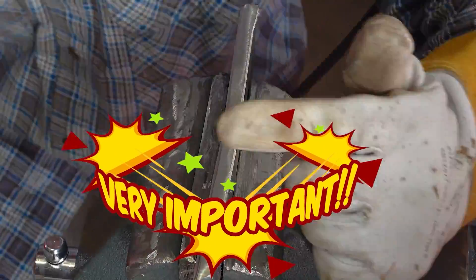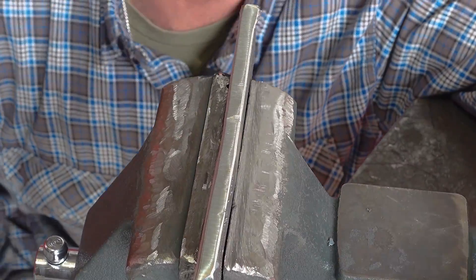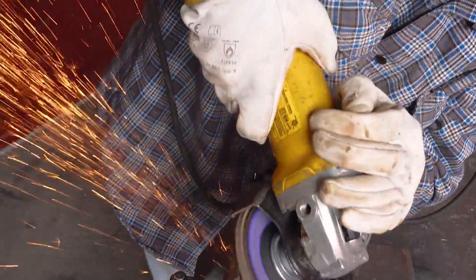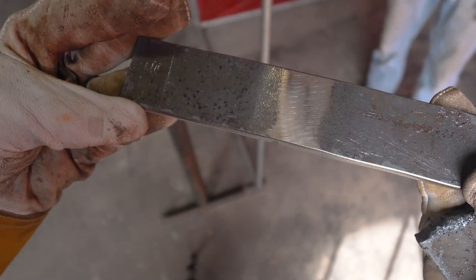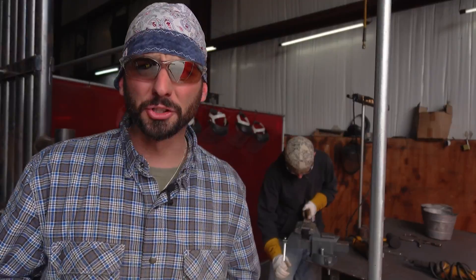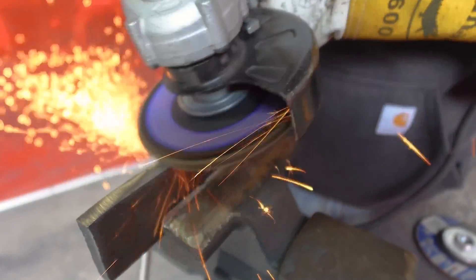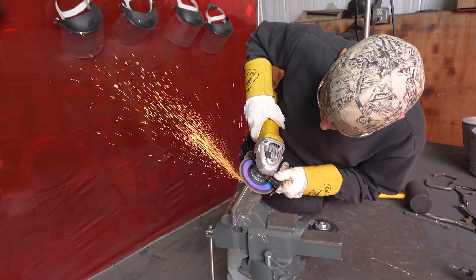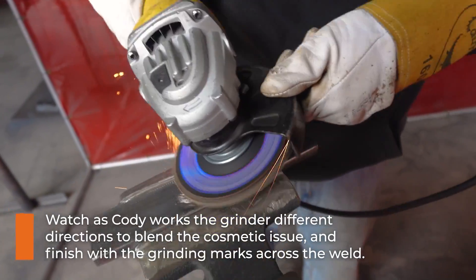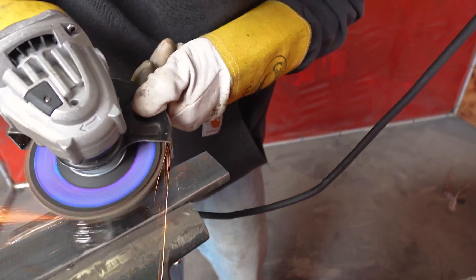It's very important that you put a radius on the side of the strap. If you leave a sharp edge it's easier to tear — skip this step and it may be what fails you. You might have had a great weld but because you didn't put a radius on there to take that sharp edge away, it could tear right there. This also really shouldn't take forever — it's six inches of weld total. Do the thing: don't wait for it to cool, get something to hold on to and get to hogging.